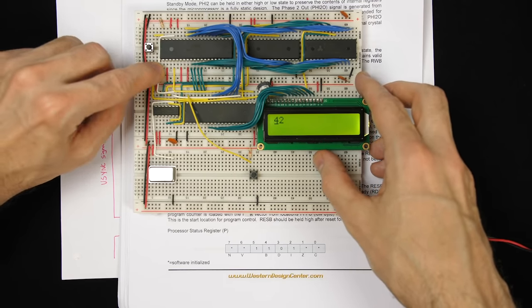The other advantage — or trade-off — is that if our display range only goes to 64 pixels vertically, we'll have a little extra blanking time at the bottom. That's 11 more blank pixels where we're not displaying anything, which we can actually recover and use for processing time. So I'll hook up those counter lines except for the top bit, and hard-code the top three bits of the address to 001 whenever the video card is active.